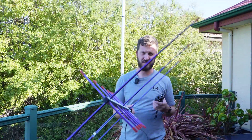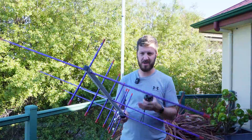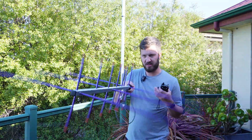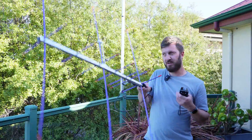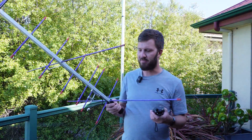This is a cross-polarised Yagi Antenna — three elements on two metres and seven elements on 70 centimetres. When I say cross-polarised, just the way the elements are mounted. It's actually fed vertical and horizontal, but you've just got to move it to wherever the best signal is that you're getting back from the satellite.